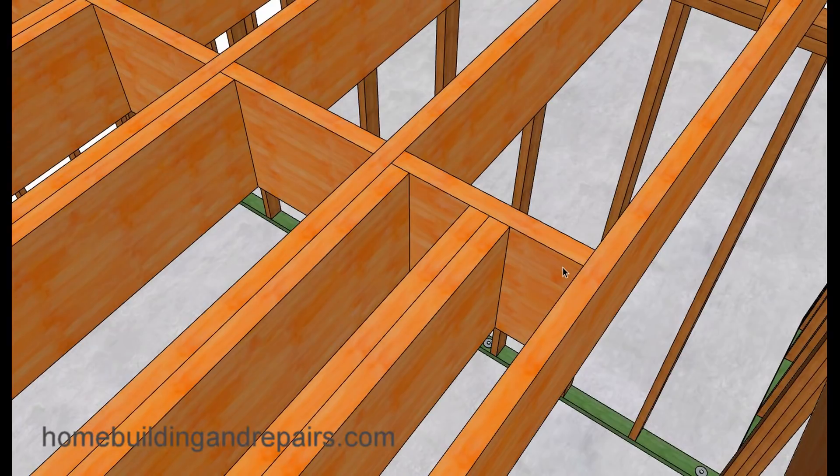Going back, we will also need to install blocks at the end of the joists to support them. They will need to nail to the existing joists using 16-inch on-center staggered nailing. You would nail — let's say you started here — you would go 16 inches all the way down. Then instead of starting at the bottom again, you would start in the middle and go 16 inches that way, so you have nails spaced 16 inches on center along a horizontal line.